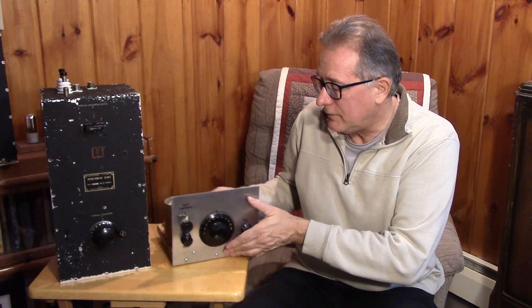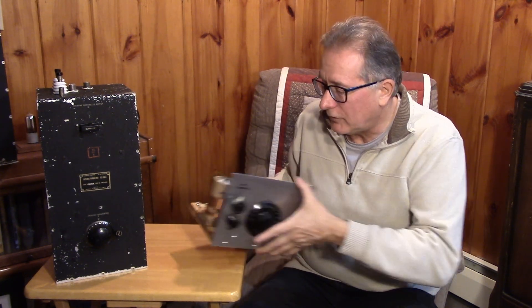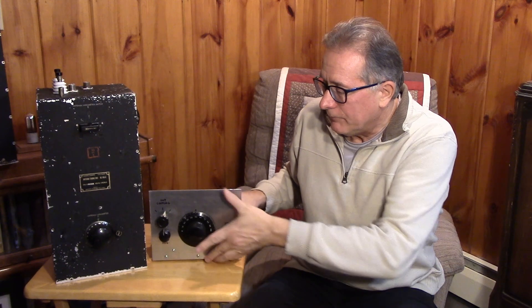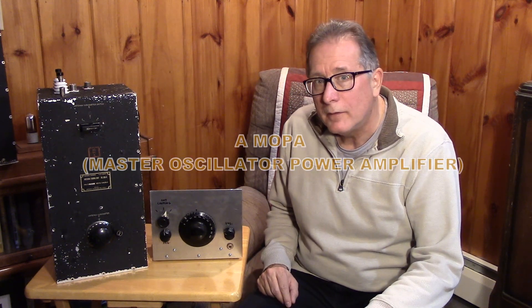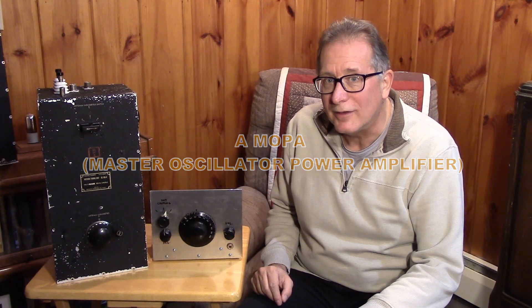You'll find that the coil will only be a little bit bigger than this for 630 meters. Maybe you want to go simple with a regenerative receiver — old fashioned, old school. On the transmit side you can go pretty simple as well. A simple two or three tube transmitter or two or three transistor transmitter will get you on the air quite easily.